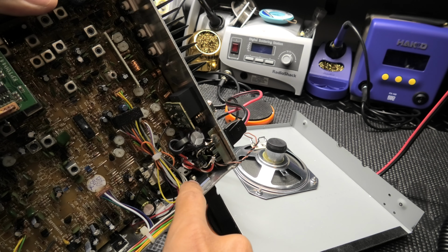I have the mic gain turned down right now because we're going to be setting the dead key. And then, because I don't know if you have a meter at home or what, hopefully you do. Always, if you're running any kind of amplifier, make sure you have a meter, a watt meter. And power is all the way down. Let's see. Okay, power's all the way down. Let's turn it on and see what kind of dead key that gives us. So 50 watts slug.